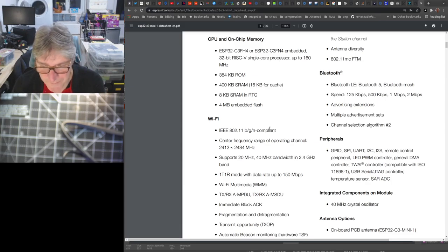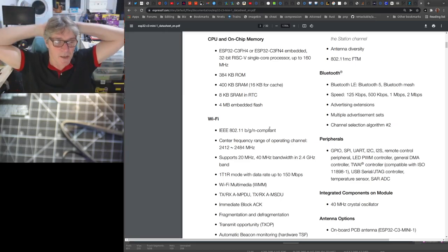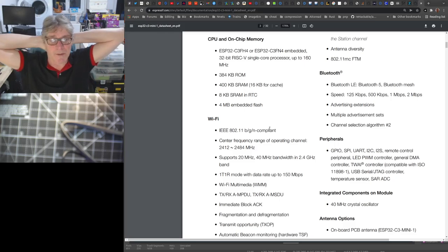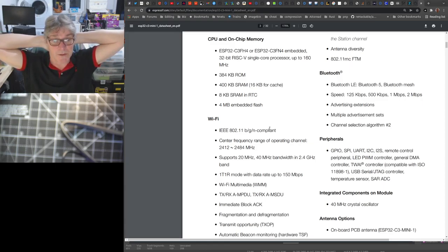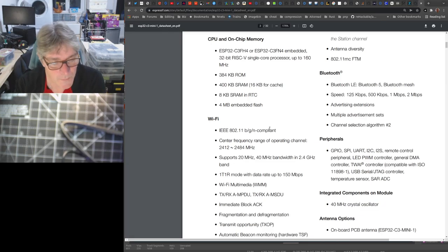However, to fully use a QSPI, what you have to do is you have to memory map, because it has a memory mode. I think it goes up to something ridiculous like 120 megahertz, which is pretty good. So in that mode, you'd make the FPGA look like a piece of memory. And then you could map in some of the local FPGA embedded memory, for example, and use that as a FIFO or buffer or something like that.